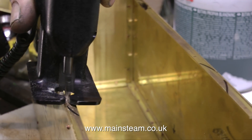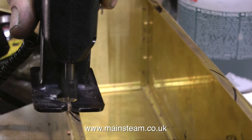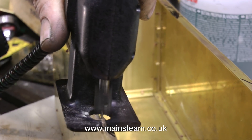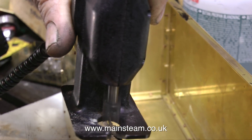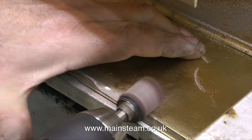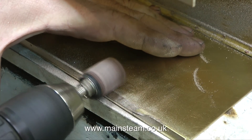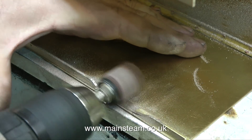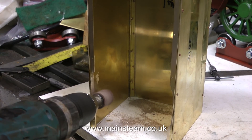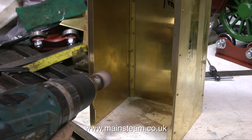I'm not putting a lot of pressure on the blade because I don't want to break it. This is a metal cutting blade, and indeed it is cutting the metal. In what seemed to be no time at all, the jigsaw took out the pieces of metal. I'm then using the drum sander again fitted to my electric drill, but this time only to remove the marks left by the jigsaw blade — first down one side, then down the other. This gives enough clearance to just slide the gas canister into position in the water tank.